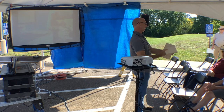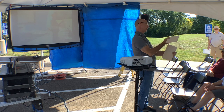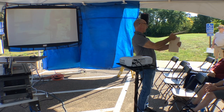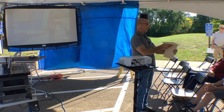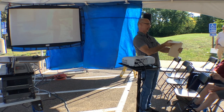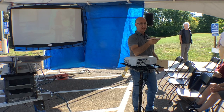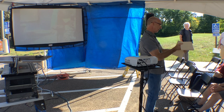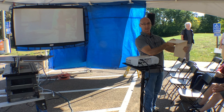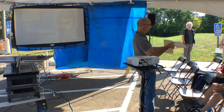That'd be cool. If I miss with the fence, if I don't set it far enough, that face will project past this end. So easy fix, right? Then I just sand that entire face till it's flush. Okay, thank you for giggling. No, we don't want to do that. Especially with plywood, you'll sand the veneer off in a heartbeat. Alternatively, if I set it a little bit too deep, the end grain is past the face. So in my woodworking, my choice is, I'm gonna make the mistake I know I can fix.